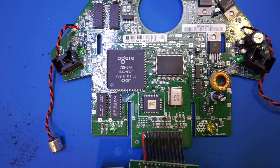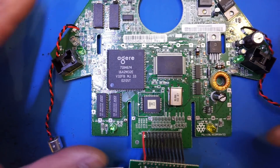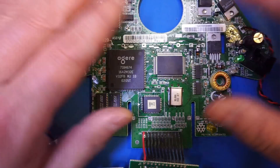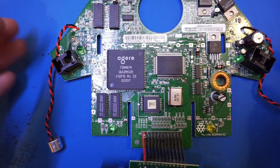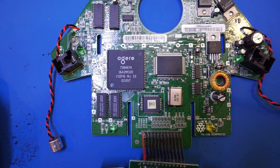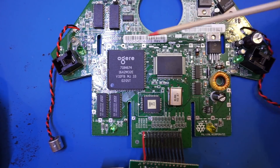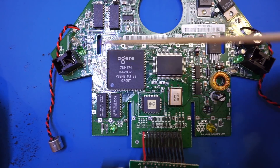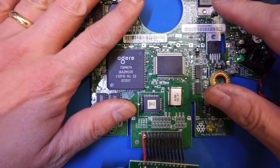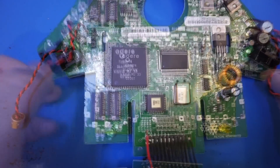Check this out — I guess I was wrong. This unit does have a significant processing portion, and it's just hidden under that shielding metal can. After removing it, we can see a couple of chips of interest here. The metal shielding can was a little difficult to remove — there are quite a few solder points, and the metal can covers both the top and the bottom of the PCB. After removing the metal can, we can see what's going on here.